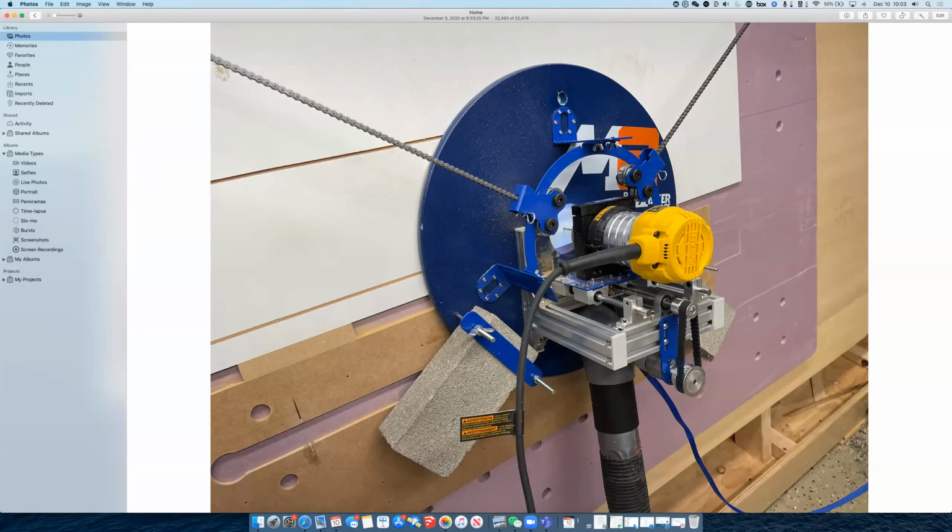It looks like, though, that there's some thought or design into where they're located and how they're oriented. Like when I look at this picture, it's almost like the weight on the left is in line with the chain. Yes, coming up from the right. So the idea, the statics behind it, is that if that brick is in line with the opposing chain, then we are putting our downward force kind of properly centered, because ultimately the sled is allowed to rotate freely on the chains. So we're just trying to extend those lines from the chain across the sled and to the weight. Because what you've run into is when you put the weight dead center at the bottom of the sled,